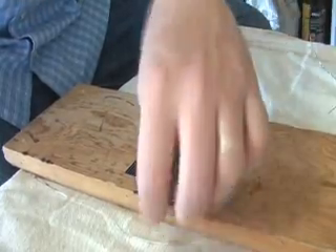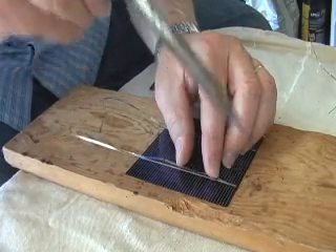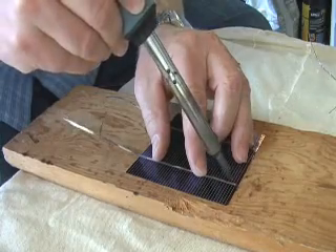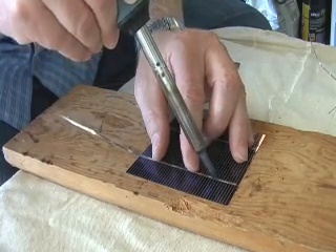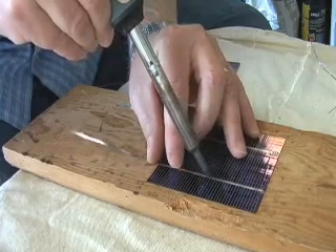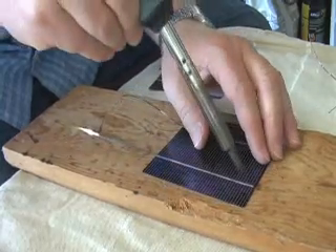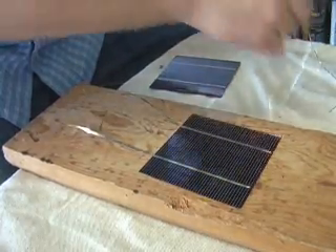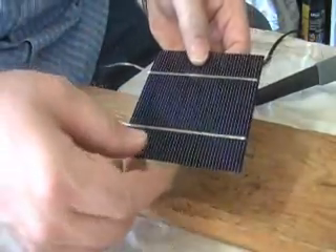Let's do the other one. The important thing is, put a little dab of solder so it's a place to anchor it. Then line it up beforehand with your fingers. Don't put the soldering gun right on the solder, because then you're going to undo that and the thing will slip. Start about a quarter inch down, make sure it's flat. As you're dragging the soldering gun along, you can feel it when it's flat — just drag it along. Go back and get that little piece you didn't do at the start. And that's really it. Put your soldering gun up and you've got a fully tabbed cell, nice and smooth.